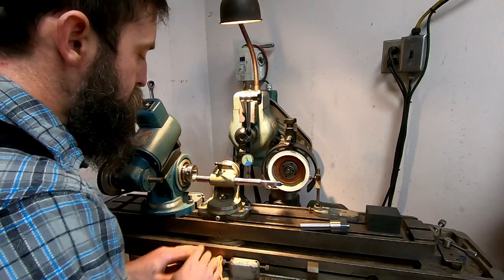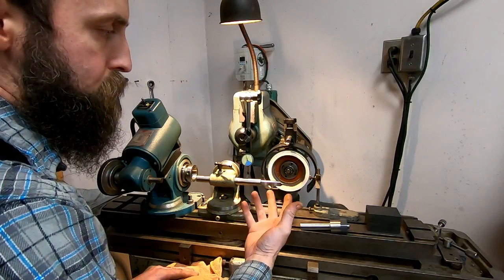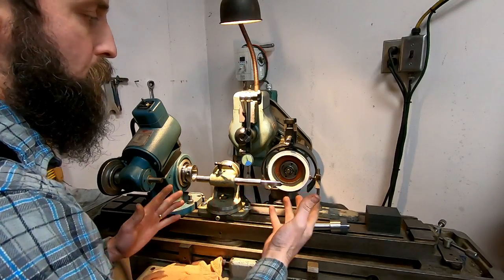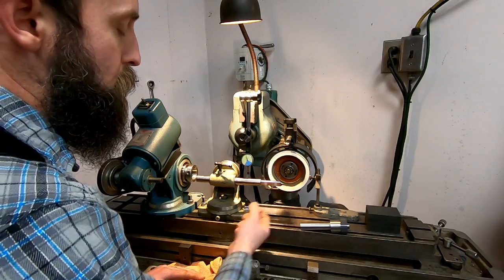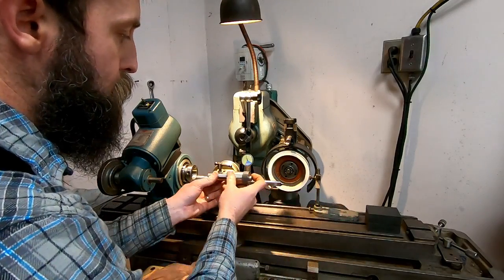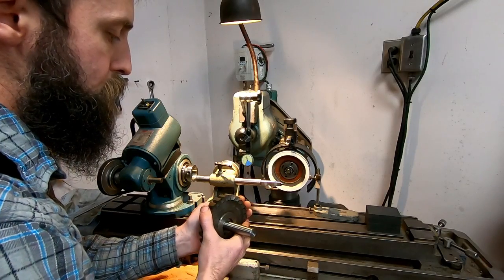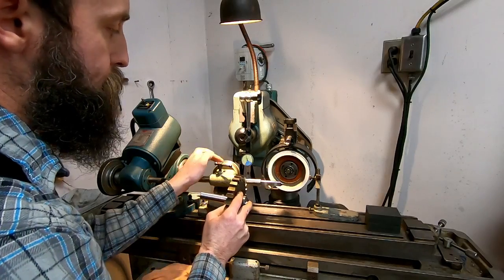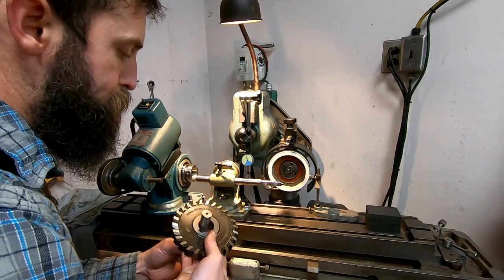So what I'm doing is using this little universal tailstock, is what it's called, I guess, for the K.O. Lee cutter grinder, and you can use it for a lot of things. You can use it as an extended tailstock. That's what this is right now, this shaft that's in there, but you can also use it to hold cutters. This is the piece that I ground just a minute ago, and then use a finger attachment off of it to index and sharpen the teeth. So I went to a cup wheel.